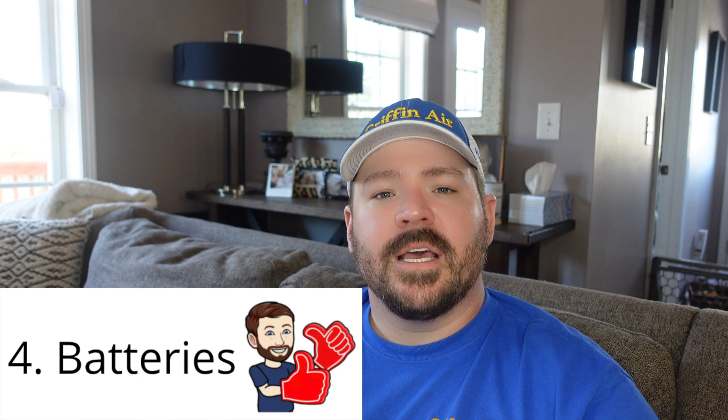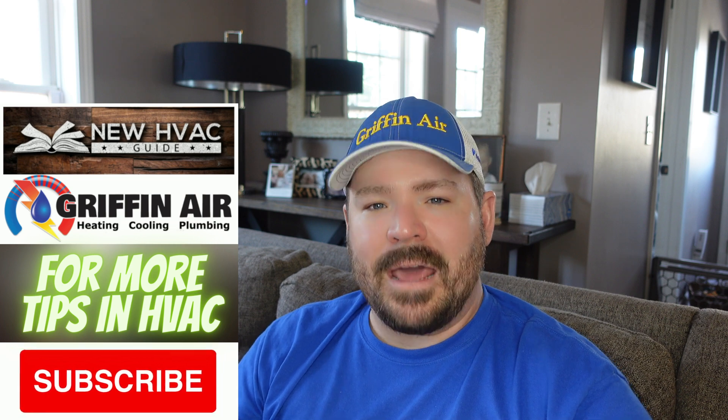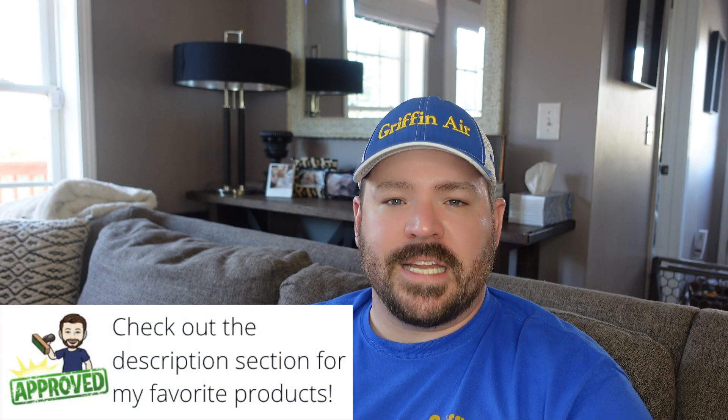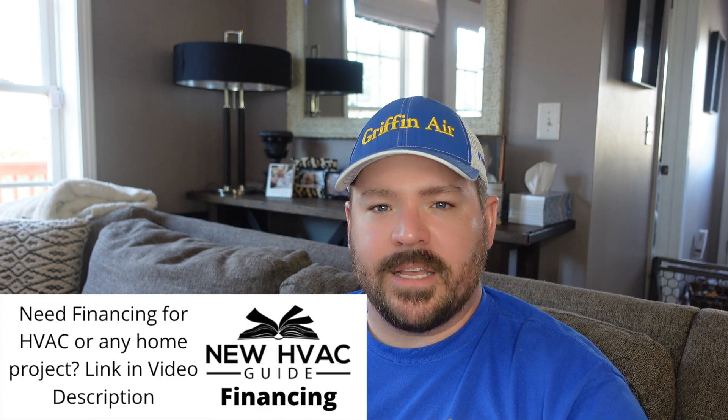Number four would be batteries. I did a whole video called 'Three HVAC Secrets that Heating and Air Contractors Don't Want You to Know,' and in that video I talked about a company where a guy would add batteries knowing that when they got low, that customer would end up having to call back with another service call. But ultimately, there are some thermostats where you just don't have a choice — if the thermostat's not hardwired, you don't have a common wire, or it would need to be reprogrammed every time power goes out. Sometimes you would add batteries to those thermostats so they operate correctly. Keep in mind, sometimes those batteries start to get low and you could have a malfunctioning thermostat that never even tells you they're getting low.